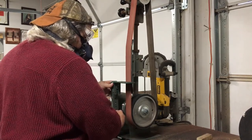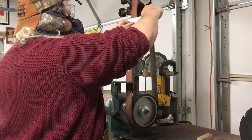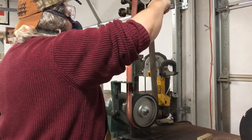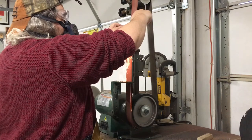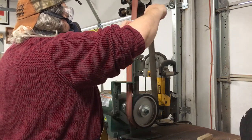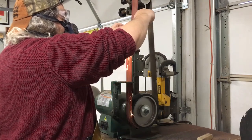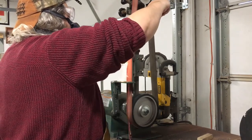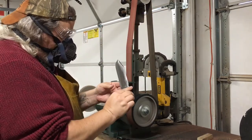I'm going to use the shelf here to get nice even passes with the blade. You can see I'm kind of using the slack belt just to clean up the edges. As I mentioned in another video, the only part you want sharp is the edge and the tip, so I'm trying to knock off any lines on the spine to round them just a little bit and get that nice smooth feel. It also adds to the professionalism of the look of the blade.